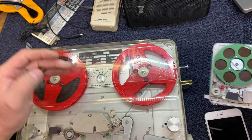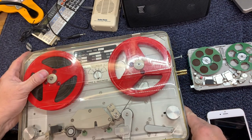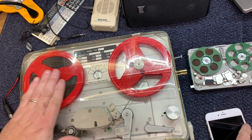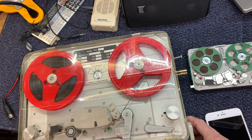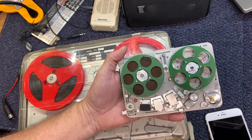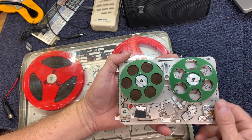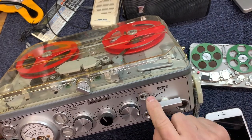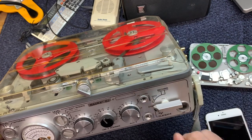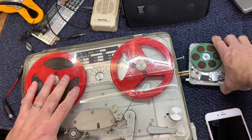And that's just a very common recording function or feature of a little more advanced tape recorders. All the good reel-to-reel tape recorders have that functionality. But you won't find that in the cheaper tape decks because it's a more advanced function and feature. The Nagra SN is designed to always listen on the playback head. It doesn't have a switchable control to listen to the tape or direct, in this case, listening to my iPhone or listening to the tape monitor. So that's the monitoring function.